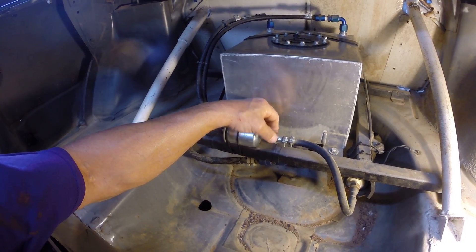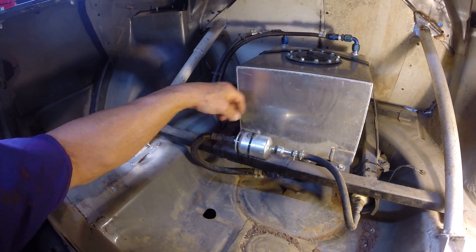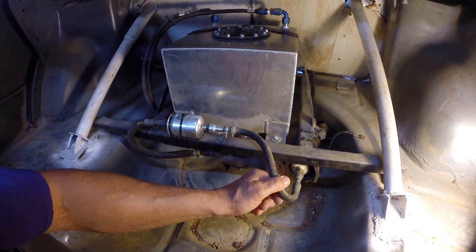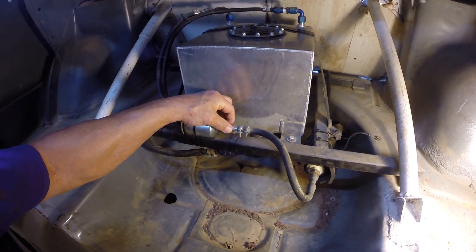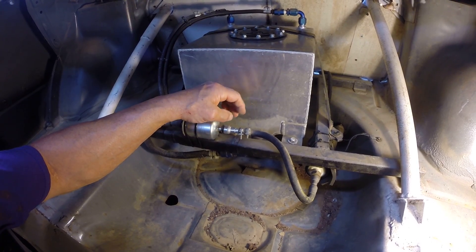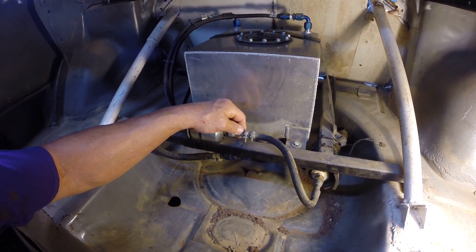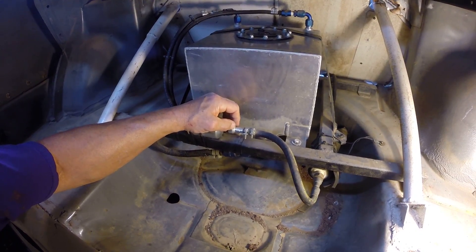There's a 3/8-inch hose for the feed line and a 5/16-inch hose for the return — the pump has a 5/16 inlet and outlet. I was a little worried about getting enough fuel, but for a four-cylinder it works perfectly. The quick connect fitting is 3/8 to match the filter, and to get that into the 5/16 line you have to make sure you put the clamps on first. I sprayed it liberally with WD-40 and really pushed hard — it goes in and seals up nicely.